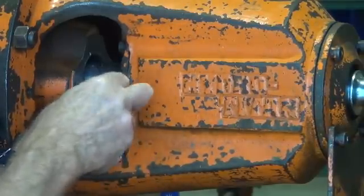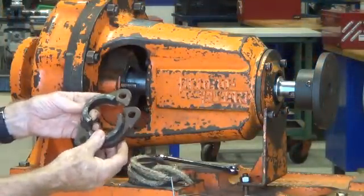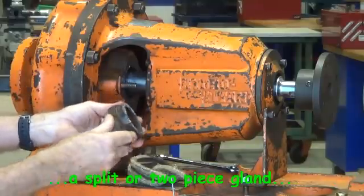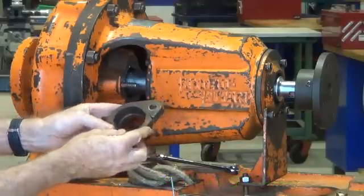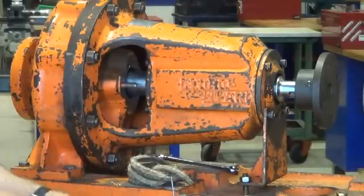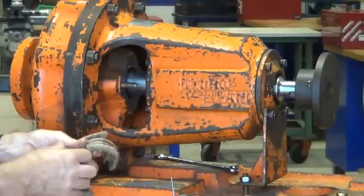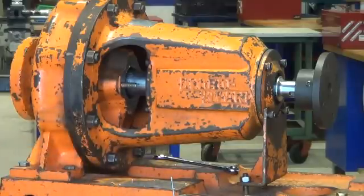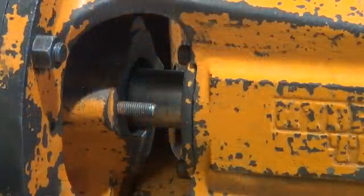Manufacturers expect a small leakage to come out through the gland and for that reason they leave a drain hole just in the bottom of the pump there. This is a two-piece or split gland, which makes it easy to just wrap around the shaft in position so you don't have to strip the whole pump down to remove the gland or to change the packing. It's important to count the number of strands — in this case we've got seven out of that pump, which means at least seven new pieces and one more probably just to keep the gland back from the stuffing box and allow some periodic adjustment on it.